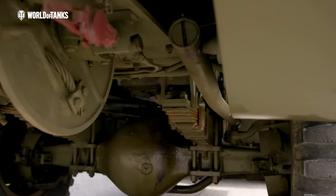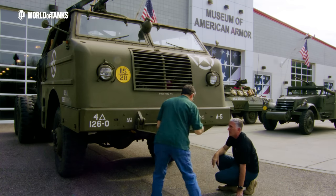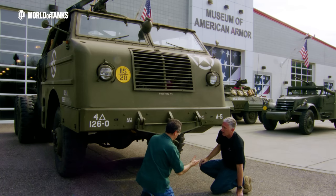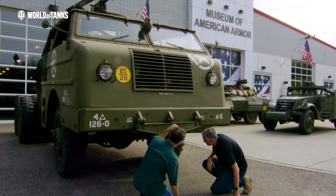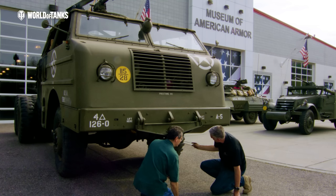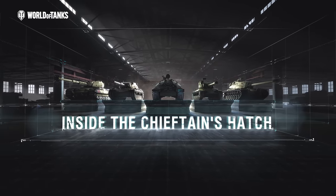The fill port for the hydraulic steering is way back and actually inside — you need a big hydraulic lift table to let it down because it's so heavy. The manual shows lowering it from above with a chain. There are no brakes on the front wheels; all the brakes are on the drive wheels in the back.